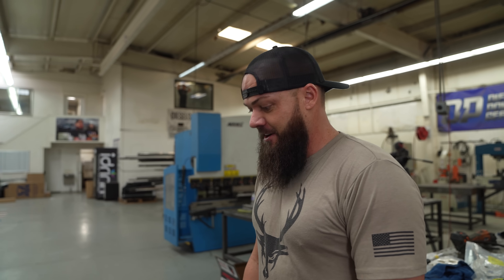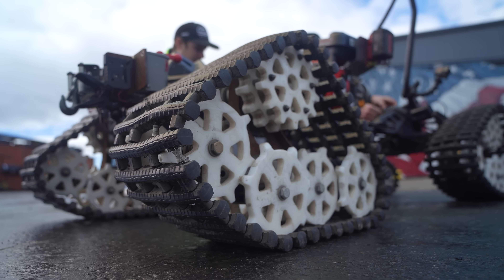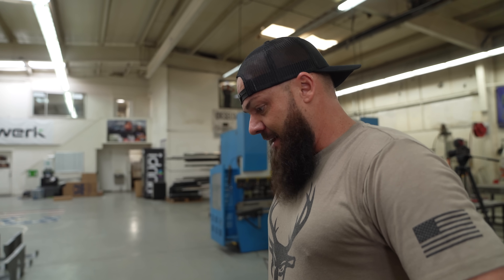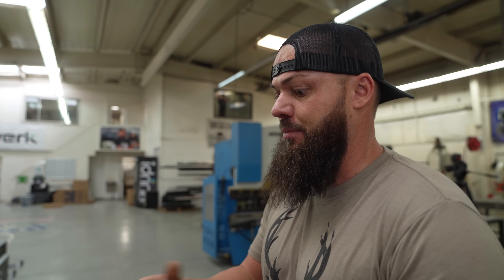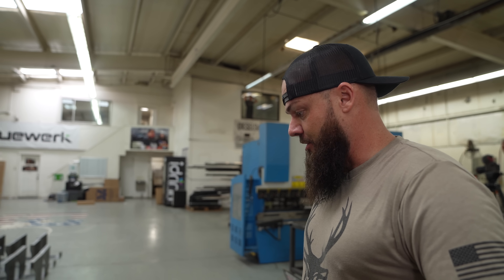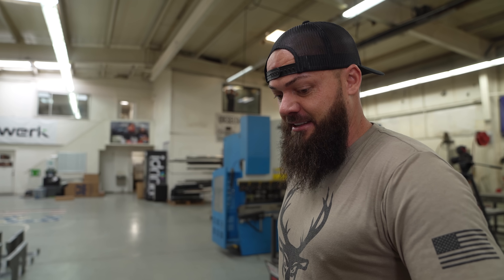Update on the mountain board — it's kind of proving itself to be a lot of fun and capable too. It climbed up over those pallets and stuff in the parking lot very comfortably. We're in the shop now — we broke the driveline out in the parking lot. I'm going to double down on this thing. Instead of putting it back in storage and forgetting about it, we're going to keep going to see how far we can take it. The plan now is to get rid of these Mickey Mouse tracks and put some Polaris ATV tracks on it, replace the drivelines with better CV joints, and probably adjust the clutch. Bigger tracks are going to rob more power, but I'm pretty sure we can get a little more by adjusting the clutch. It's about to get significantly more bizarre than it already is.